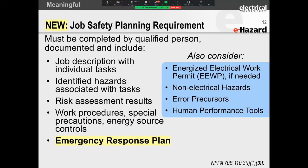What's the reason that the fuse blew? So that's going to be the job description. What are the individual tasks? The individual tasks are going to be, first and foremost, try and create an electrically safe work condition from the plug downstream, so that my work does not cause any harm to anybody downstream. Then create an electrically safe work condition on the bus ducting so that it's safe for me to work in that bus plug. Then how am I going to open that bus plug? Does the lever need to be in the off position? Do I need any specific tools?